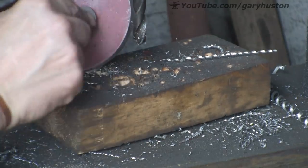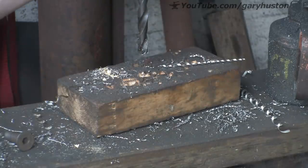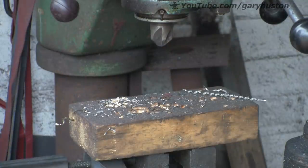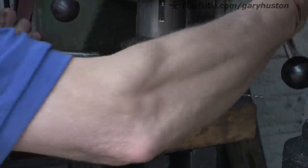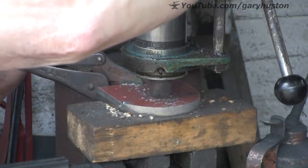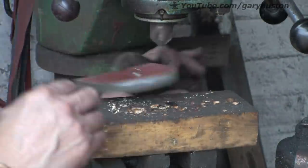There's one. So I'm going to countersink that now — if I can find my big countersink tool. I've got a big Morse taper one somewhere. I've found it. Unfortunately I think it's a bit blunt — it could really do with sharpening up. It's chattering away but it's just about doing the job. All my other ones are a little bit too small, so it has to be this one.